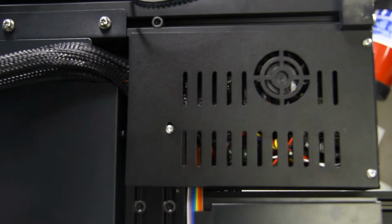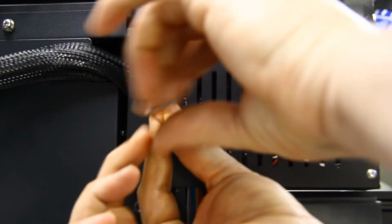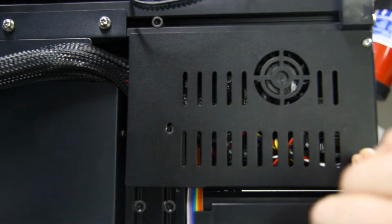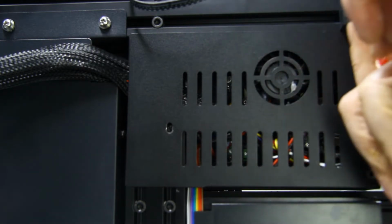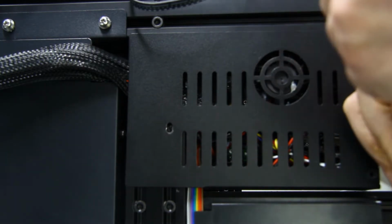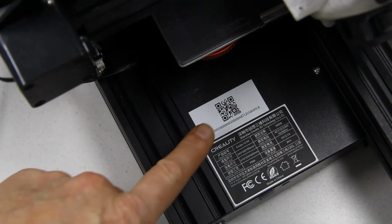To access the printer's main board, one needs to undo 4 screws, 3 at the bottom, with the longest one being furthest back, sort of closer where the cables come out, and 2 right at the front. Flipping the printer over, there's 1 at the top, sort of towards the center.